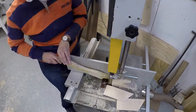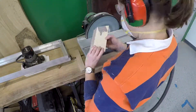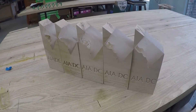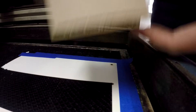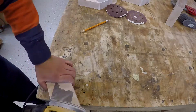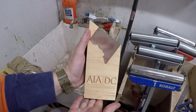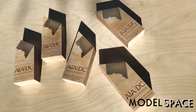That's going to leave a pretty rough finish, so I'll come back with a circular sander to clean up that surface — and this is what it looks like before the final sand. Of course I also have to etch in my website, yourmodelspace.com. For the final sand I'm using a palm sander, going from 120 all the way up to 1500 grit. Just to give an idea of what the final look will be, I'm running it under some water.